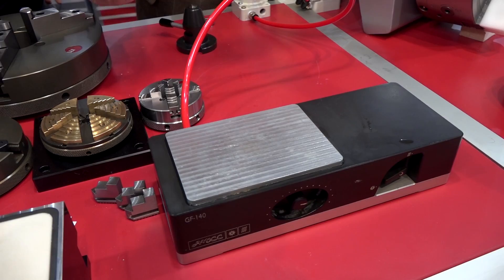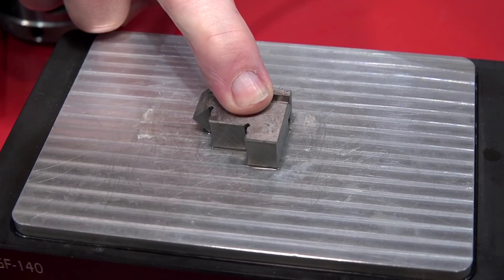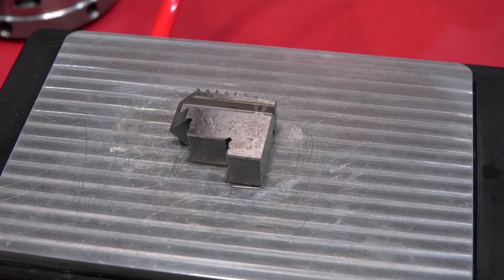We clamp products on here with the use of ice. We put a few drops of water on there, place whatever product we want to grip on top of the water, and press the product down to expel the water from underneath. That way we know the product is down on a ground face — we know exactly where it is, we've zeroed it. By pressing it down, the water is now lapping around the periphery, the outer contour of the workpiece that we're going to hold.